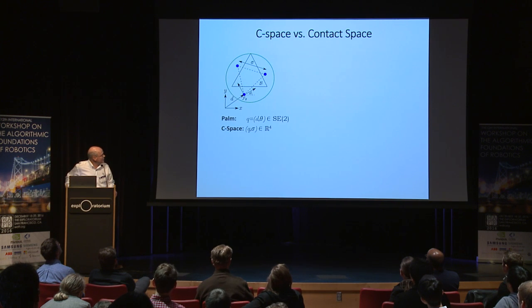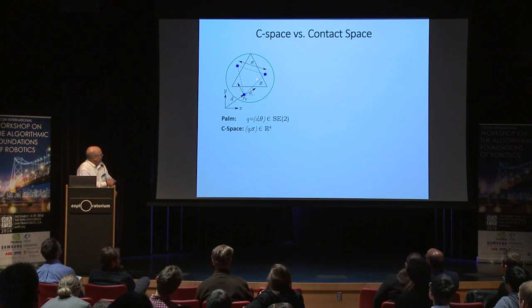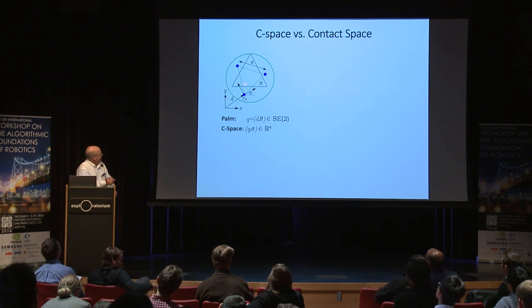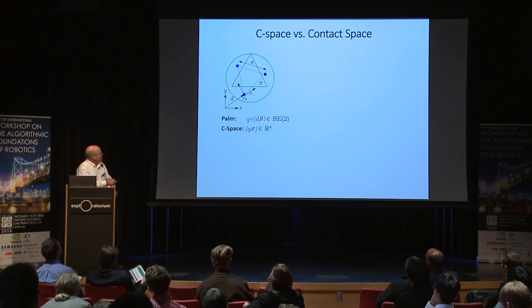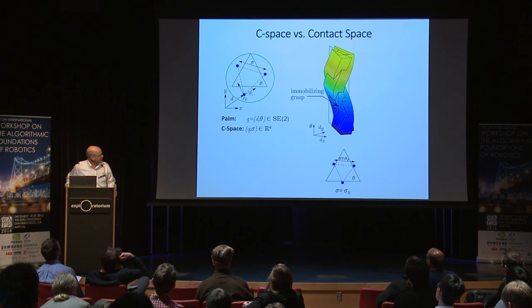So here's the idea, if you don't know anything about caging, from the configuration space point of view, we have a sort of three-fingered object here, and we assume all these fingers are attached to a palm, and so the palm can kind of move in 3 degrees of freedom, but we assume that all the fingers can open and close simultaneously with sort of 1 parameter. So it's a 4-degree of freedom configuration space.